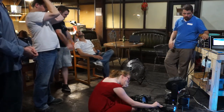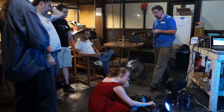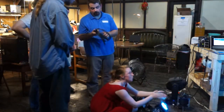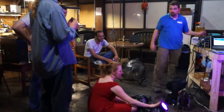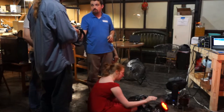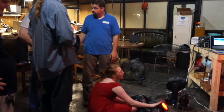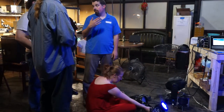Is it a different kind of cable? Yes. The actual rating on the cable is much different. Here's a microphone cable, and you can see that this cable is much different than this one. That one does not have an actual shield that runs along it. This one does. Both of them have drains, and both of them have three conductors carrying the balanced signal. Could you plug them together? You can, with very short ones. It's not going to damage anything, but the signal is going to become muddled. You're going to have a lot of reflection down the line.